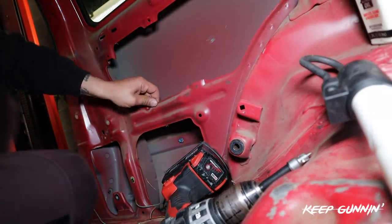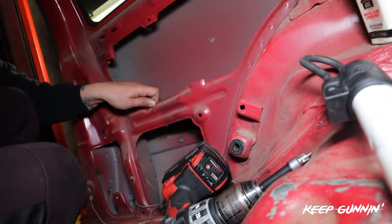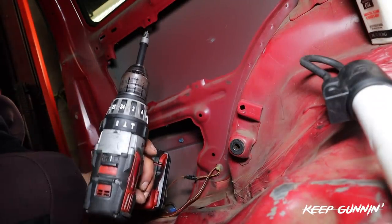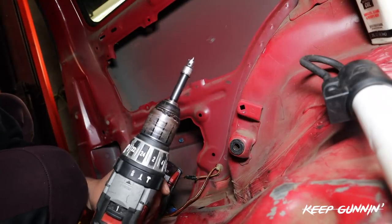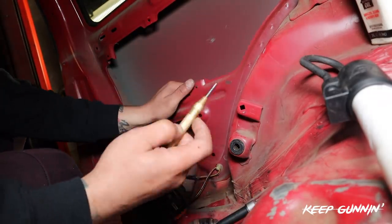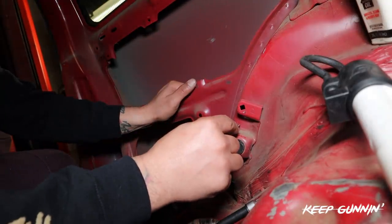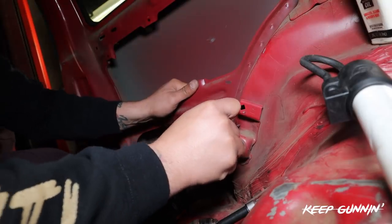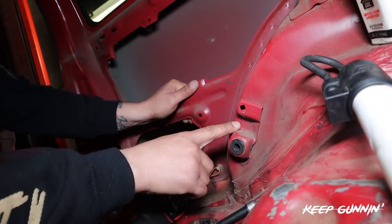So there's a few things I really want to get out of the way real quick. Lowest setting — put it on drill and leave it at one. You're not doing this fast. This is tedious because it's going to come out nice and clean. Take your time. So the first thing we do is use the center punch. Now we don't do it once — we want to make a nice groove for the bit. One, two, three, four. We have a nice groove. We're set to go.